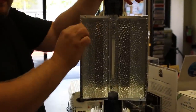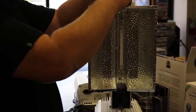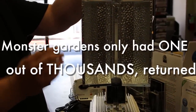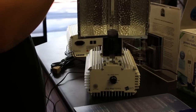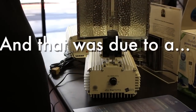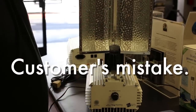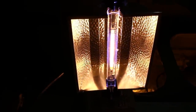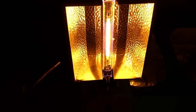If you don't close these connectors properly, you're going to have arcing and you're going to be in trouble. Make sure they're nice and closed. If they don't close, you will get problems, start arcing, and the lamp will start going black. It's not a factory mistake — it's a customer mistake. This compact fixture is for people with lower ceilings who have less height. It's a great solution to still be able to utilize the double-ended technology.